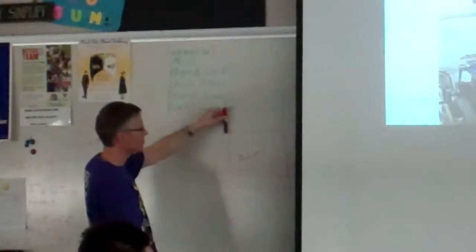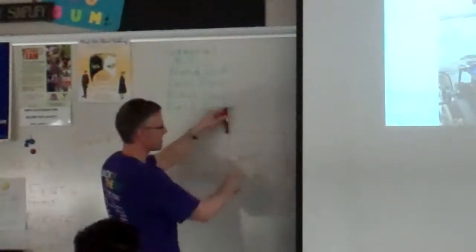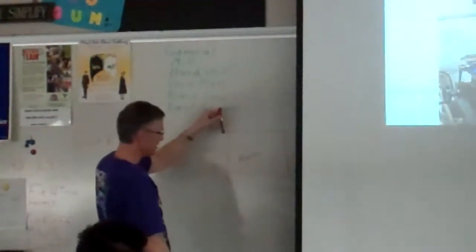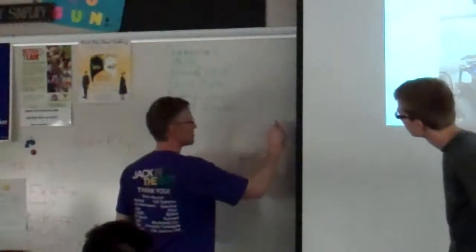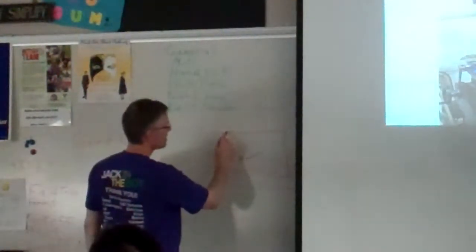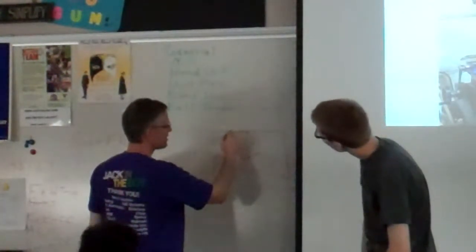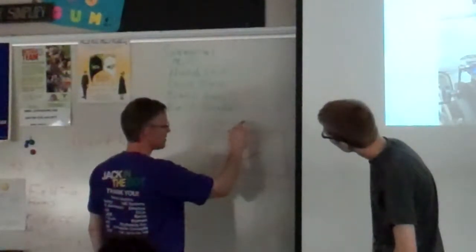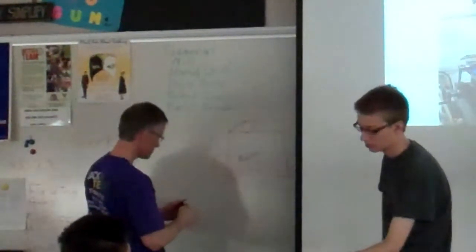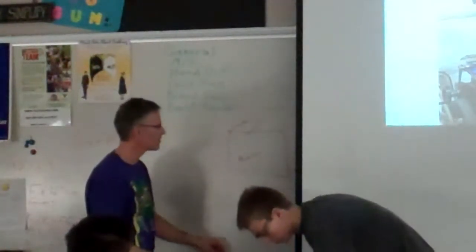Once you set 0, you'll know basically anywhere you go on this x-axis where you are, like 1.25 or something like that. And so it's really nice because in 3 dimensions, right? You'll zero your x and y axis, right? So if you go 1/2 inch this way on the x, and you zeroed it on the y, you go 1/2 inch this way, and you'll end up with this nice little cut in the top of your dice, or whatever you want to call it. You cut into this piece of aluminum. So that's kind of how you go about it.